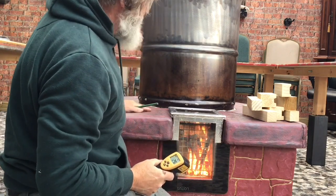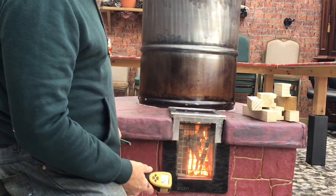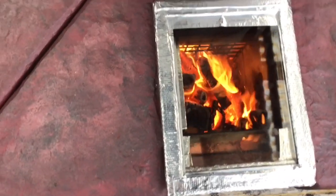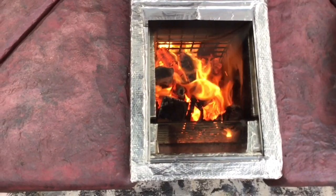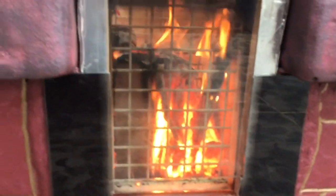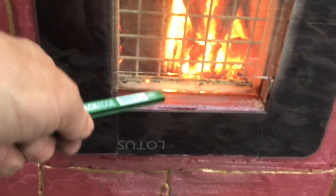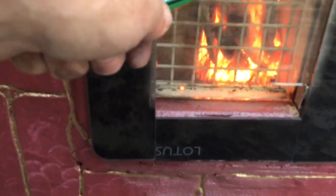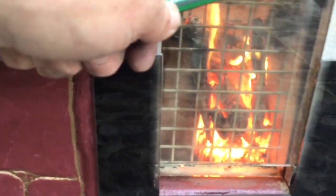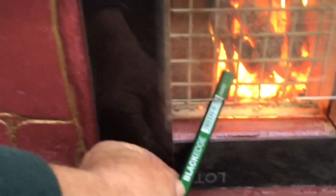It's working really well. I've got a new load of wood to put in very shortly. A quick look in the firebox - it's burning away, still on the first load after about half an hour. You can see how the glass has stayed clean. There's a very small gap at the bottom which allows a certain amount of air in, which I believe runs up the inside of the glass and keeps it smoke-free. The main source of air is running up in between two panes of glass.